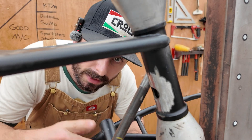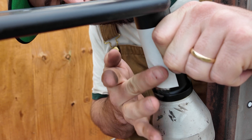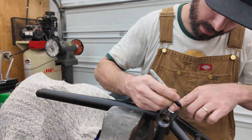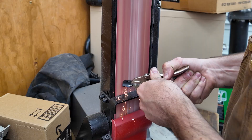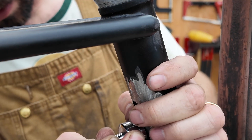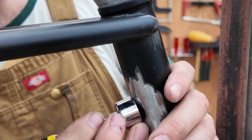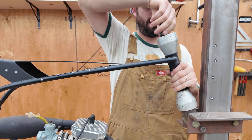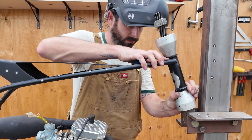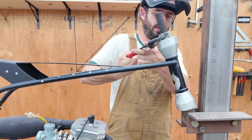I'm going to try and cut this out first. Take a piece of paper, cut something to size, and gently feel around the edges to get a little circle. That'll work. Question is how do I hold it in there while I'm welding? Of course it went in the hole — at least we know it fits. Question is do I cut out another one or do I just take this off? You don't normally want to take something out of the jig before it's all complete, but this will be fine. They're all going back to the same thing. I'm not bending on anything. It'll be fine.